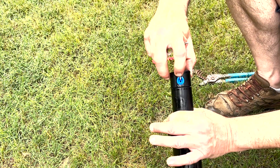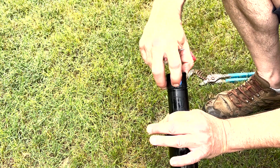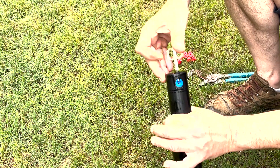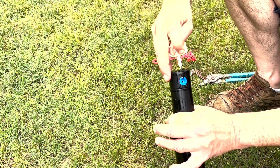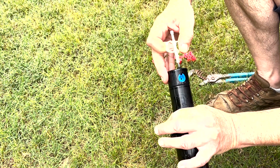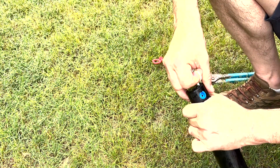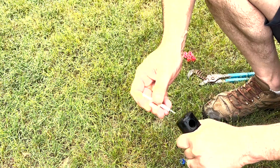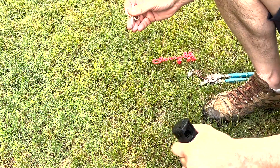As we see here, there is a screw holding this nozzle in. So what we're going to do is take our hex key and run this screw back out of there just enough to where it's not going to catch the nozzle. You're going to remove an existing nozzle — sometimes you've got to get a little bit rough with it and pull it out.